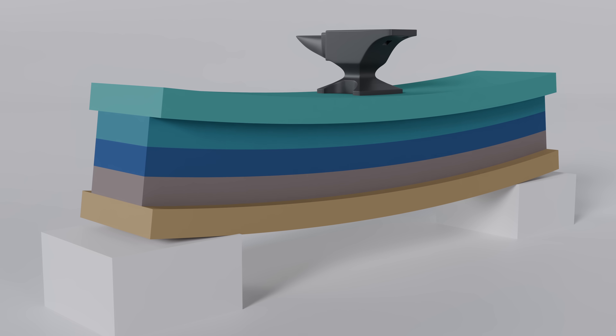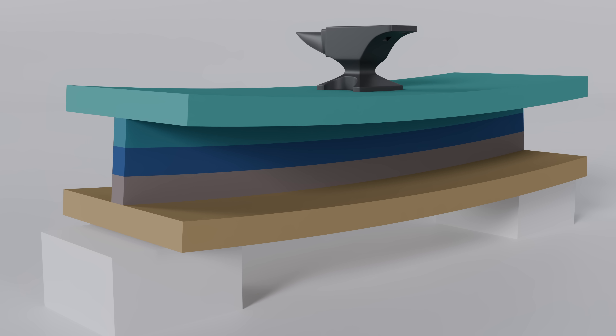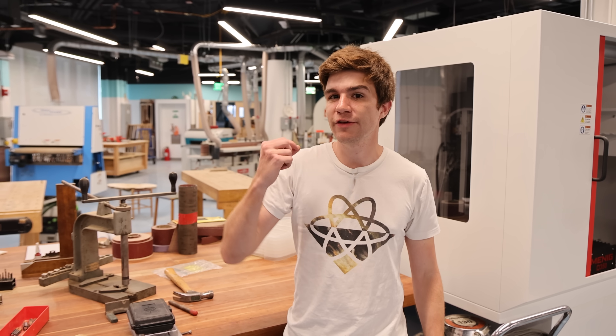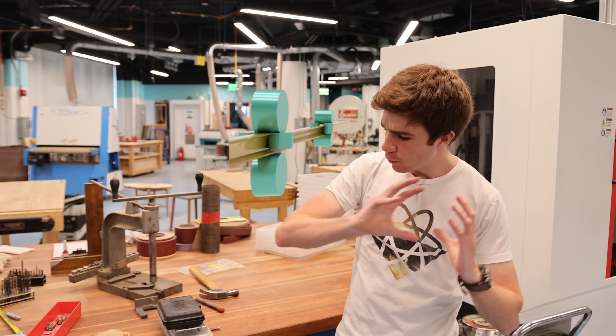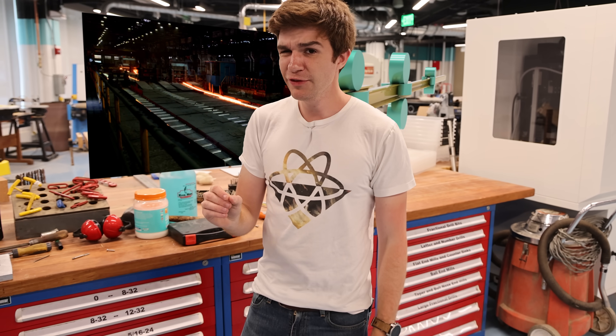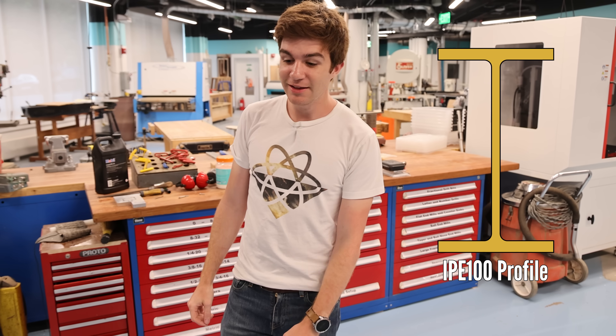More material means greater resistance to deflection. So our optimal solution is to put literally all of the material in the upper and lower flanges, protecting the stuff held in the middle. In the real world, the way we produce I-beams is by hot-rolling structural steel — literally squeezing out the desired shape. Once you get it going, you can produce up to 100 kilometers of beam every single hour. Although the reason it works so well is because the I is intrinsically a very simple shape.